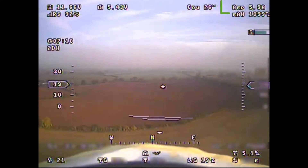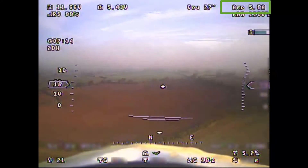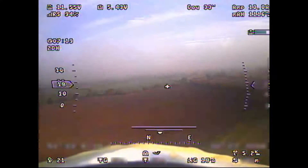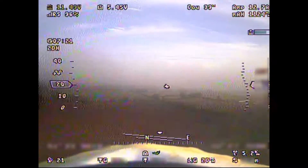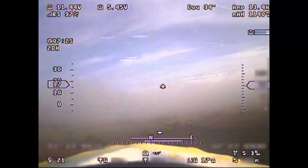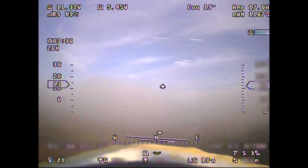We've got amps — that's the current draw by the motor and all the electronics. Right now we're running at 5.9 amps and you'll notice — there you go, I've just chucked the throttle on, how's that for timing? So I've just applied a load of throttle and we've gone all the way up to 13, 14, 17 amps. It must be a full throttle moment for me to get some height.